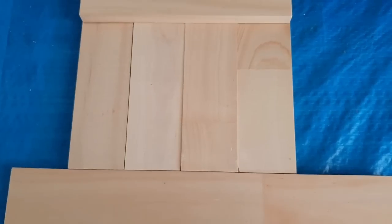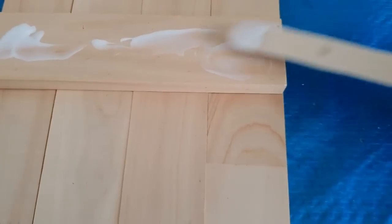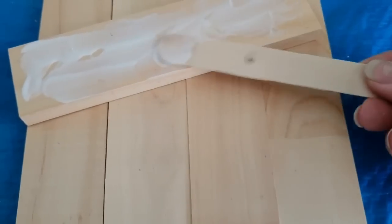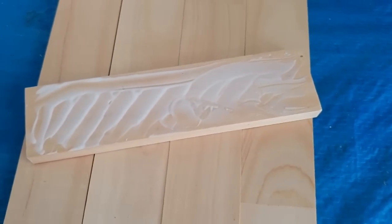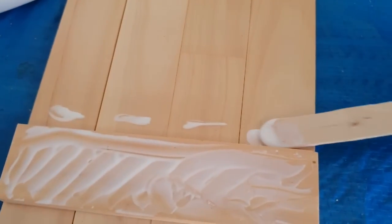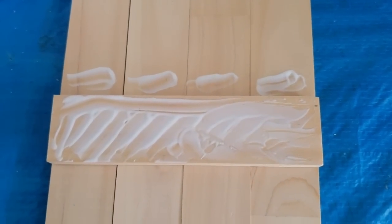Making sure their ends are all flush, I have some PVA wood glue. I've put some of that into a little shot glass because that's far easier than trying to tilt the whole bottle. Just spreading that over the support piece, then put it back in place and add a little bit extra over to where I'm going to flip it over onto the slats. That's the placement when I flip the support over onto the glue on the slats.